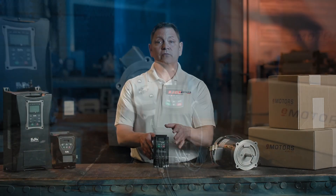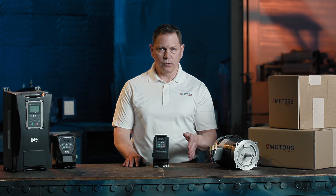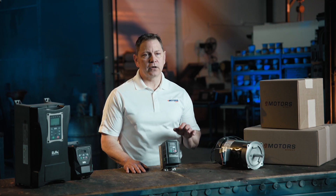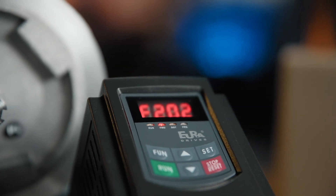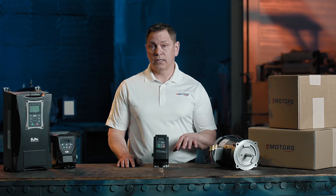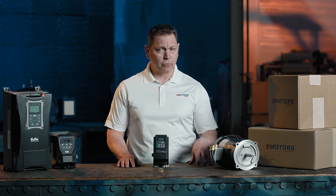This is EuroDrive's broad voltage VFD with options for 115, 230, 460, and 575 voltage input. One of the defining factors of the E2100 EuroDrive VFD is its sensorless vector control mode selection, which provides precise speed and torque control without requiring an external encoder. This makes it a cost-effective and reliable choice for applications requiring high-performance motor control.